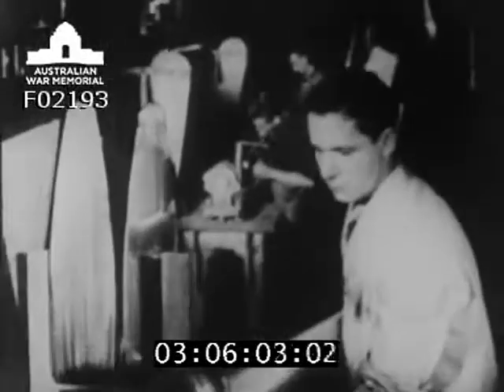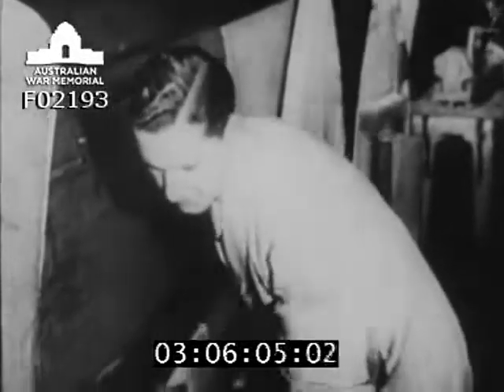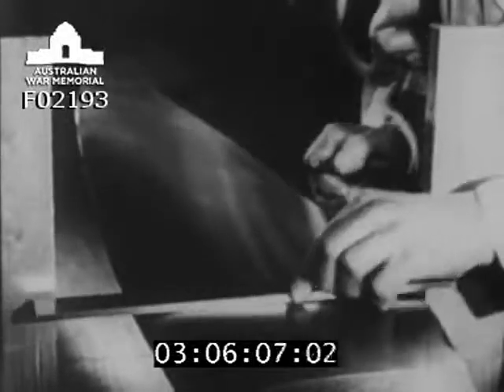From now on, the blade is hand-shaped by skilled craftsmen. This is done on a special table marked out with equal divisions called checking stations. These stations are marked onto the blade so that a regular check can be kept on size and shape.